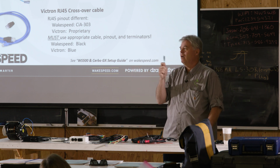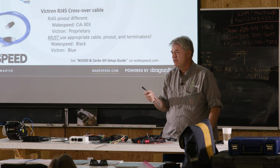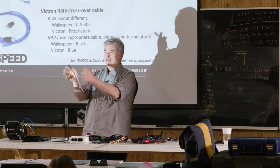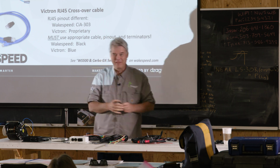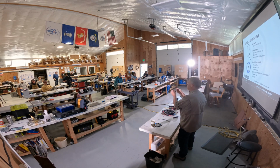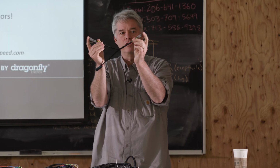So I'm only telling you that because if you find some of our older documentation and you come across, well, what's an M12 or why is it a DeviceNet? Those all mean NMEA 2000 once you've paid the licensing fee and are a member of the company. Okay? We talked about the Lithionics CAN adapter. This is the DTM connectors, industry standard.